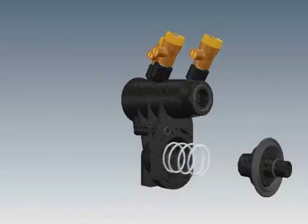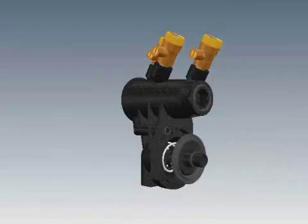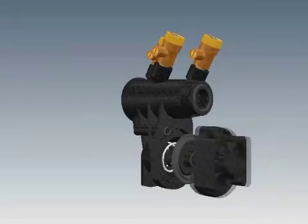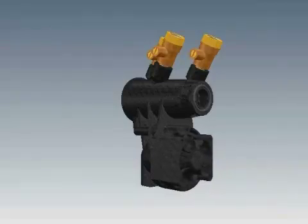Place the spring around the seat and the housing. Insert your cartridge assembly into the spring. Place the cover onto the cartridge assembly. Push the cover toward the housing and make sure the cartridge centers into the seat guide ring and the diaphragm is not pinched between the cover and the housing. Thread two screws into opposite holes by hand while holding the cover in place, then thread the remaining cover screws into place and tighten all screws evenly.